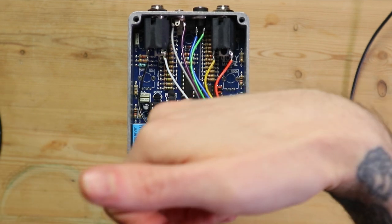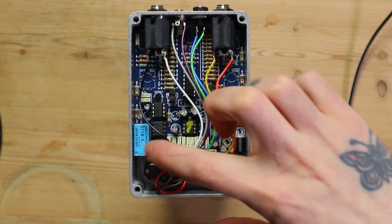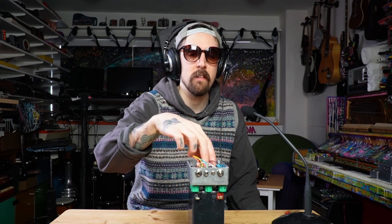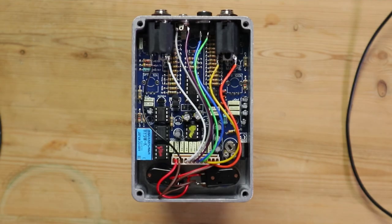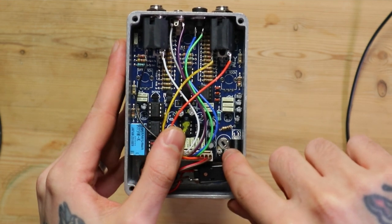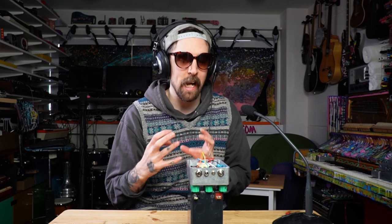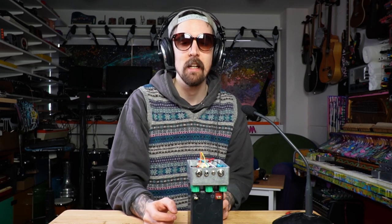And there's quite a lot going on. What's working with the relay is a microcontroller. And then Kose actually has a second microcontroller that is specifically for the sample and hold. So it's separated into two small ones, and that's for reasons that we might discuss in the podcast. However, as you can see inside of Kose, there's also a trim pot over here, and that's where you can yourself tune the wave shape of the analog LFO that is going at all times in Kose that is being sampled.